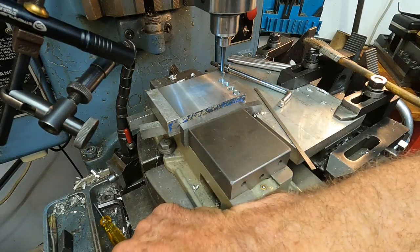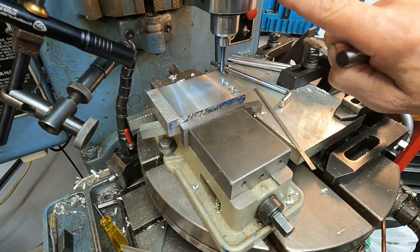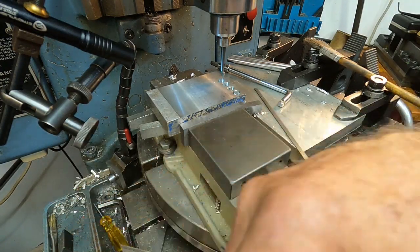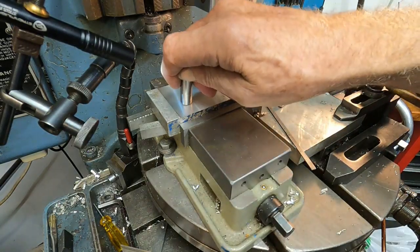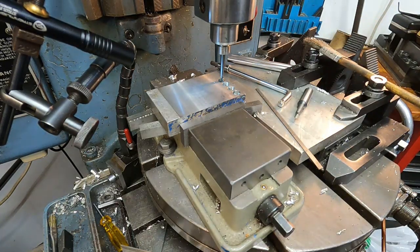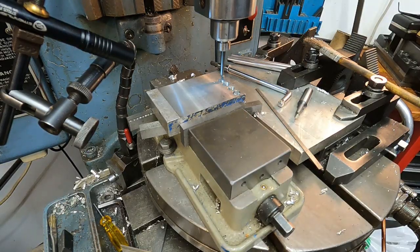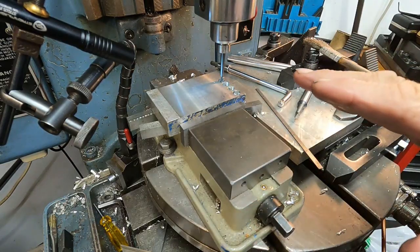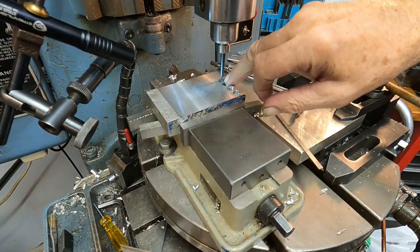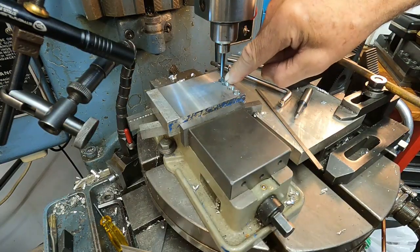I've talked about these spindle bearings — that's a problem if there is a problem. So this is how you control it. I will get back to boring these holes and I think I'll just call this a separate video — 'boring angles' or something like that. I thought that might be helpful, because it's better than guessing at stuff. It's better than sticking a bar in a hole and, if the heel is rubbing, rotating the bar until it doesn't rub — because you're getting the tip off center that way.